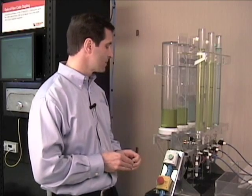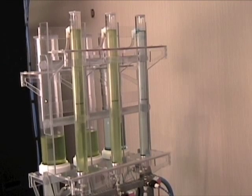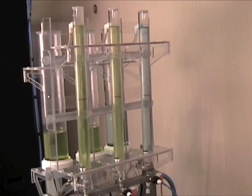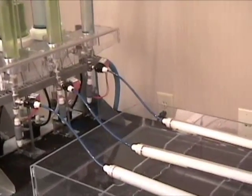So let's start the tests. The apparatus is designed to apply a 30-inch water head pressure to each of the tubes under test. The tube closest to us is filled with PFM gel, and that is being tested with salt water.